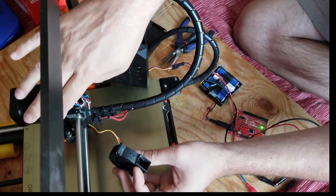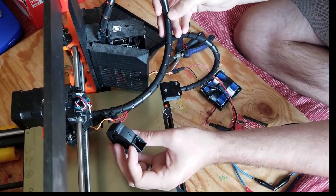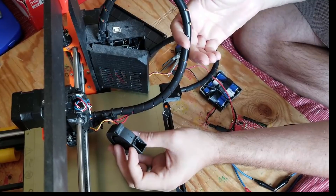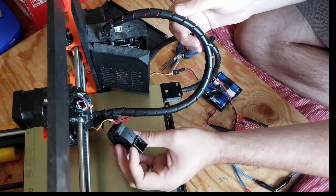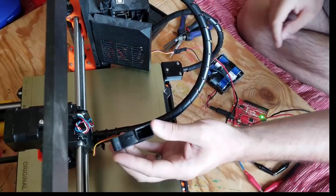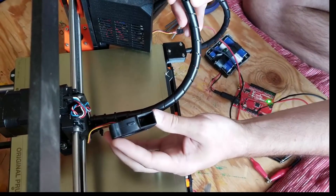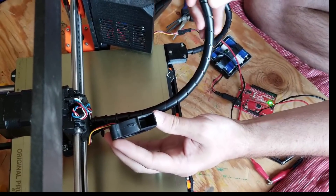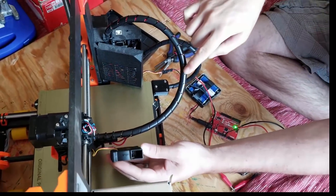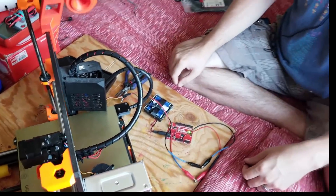Now you're not going to work for me, are you? Oh, there we go — so now we're dead. See? We're dead. I can probably wiggle this and get it working. There you go. So that tells me somewhere along this line it's gotten frayed. I need to go take this whole thing apart, probably solder it back together and seal those wires up good.